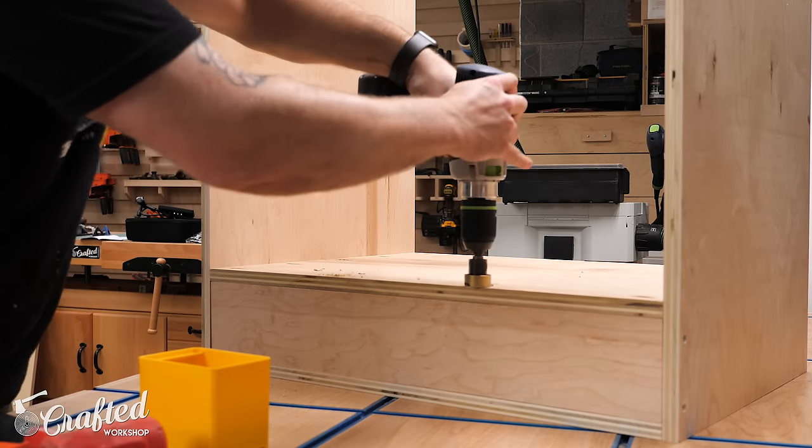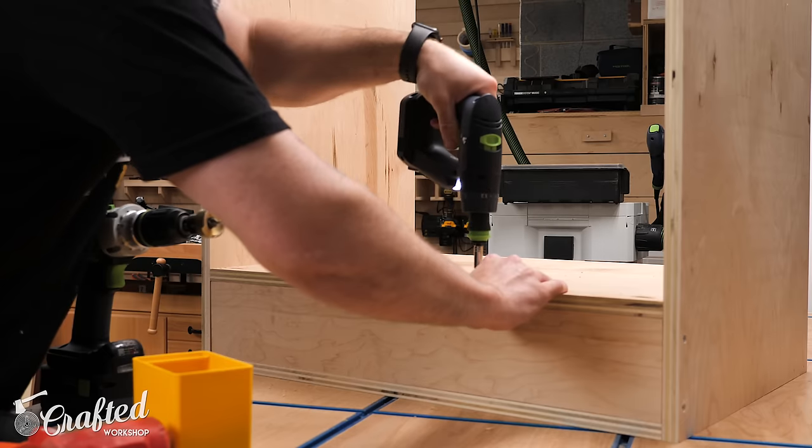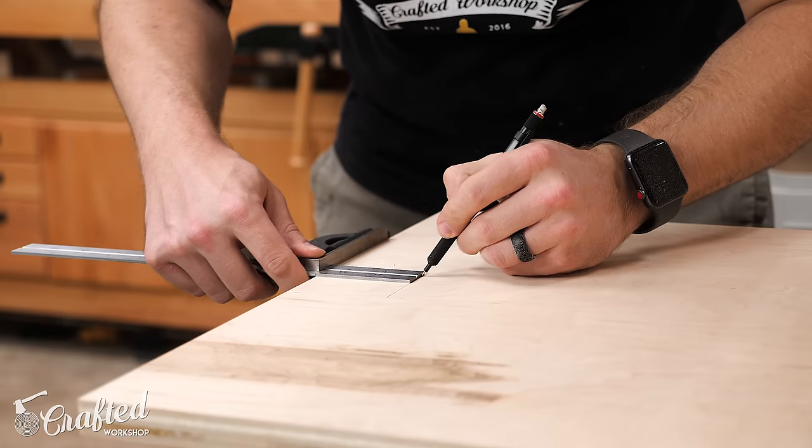Next I installed the back of the drawer compartment, attaching it with screws through the sides, top, and bottom. Pocket holes would have also been great here, but I had put away my pocket hole jig before realizing I needed holes in this piece and just didn't feel like pulling it back out. I jumped the gun a little bit assembling the carcass before making some cutouts in the sides, but with some careful measurement things ended up working out fine.